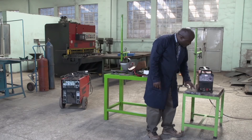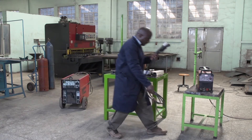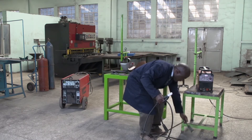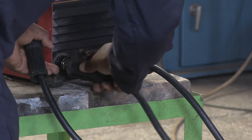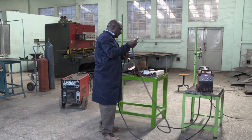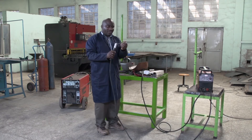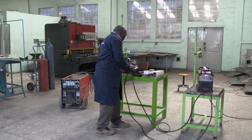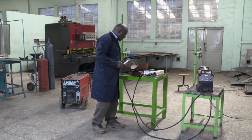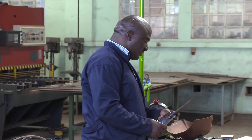That means you have to be careful when connecting this machine. We have two cables: the electrode cable can be connected to the positive, and then we connect the other cable to the negative. This means that the electrode will receive a large amount of heat compared to the cable connected to the negative, where you connected the base metal. If we interchange the cables on a DC machine, there will be an effect, because the heat is not distributed equally.